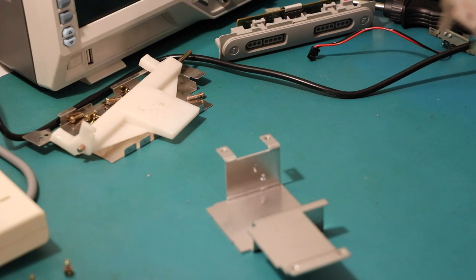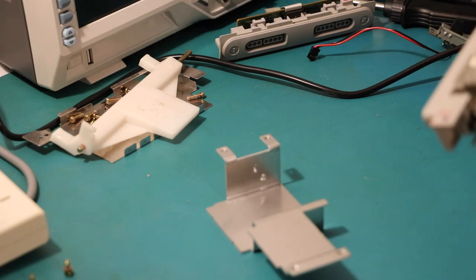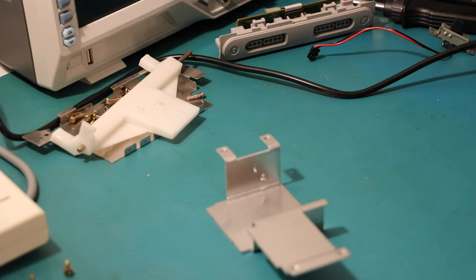So what we got? 33s, 47s, radial. Two radial capacitors on here, which is nice. Well, three if you count the big one. 220. 220. Cool.